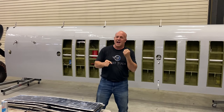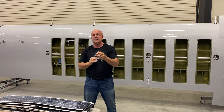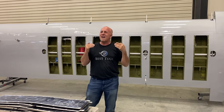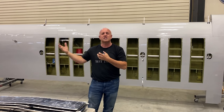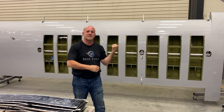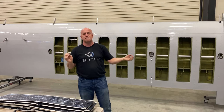It can't happen. The actual full stop of the complete movement is the linear actuator itself, both electronically and mechanically. After that, the torque tubes also have stop outs, lockouts, that lock out in the main structure. But the only way that can happen is if the linear actuator literally snapped in half, which is so oversized that it's virtually an impossible event, other than maybe a crash of some kind and breaking the wings. But if it did, the secondary is a full bump stop designed into the full torque tubes that goes tip to tip and never a bind on any of the smaller moving components at all.